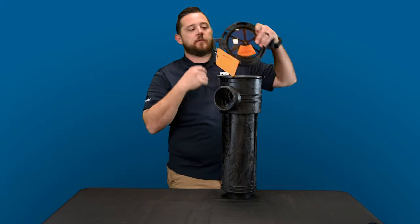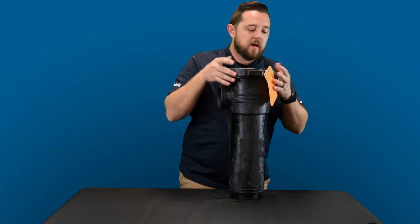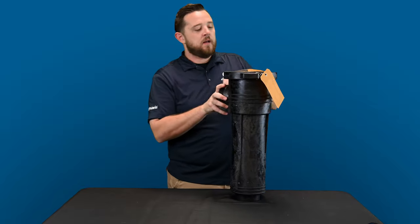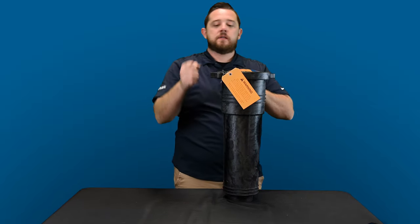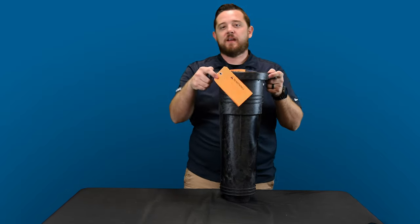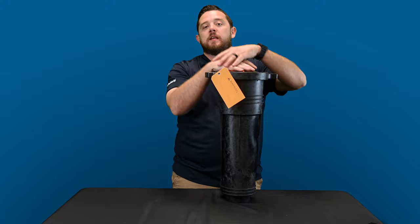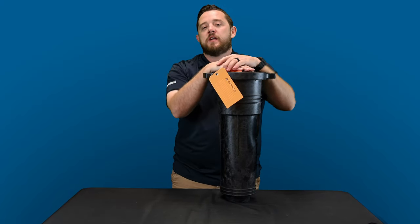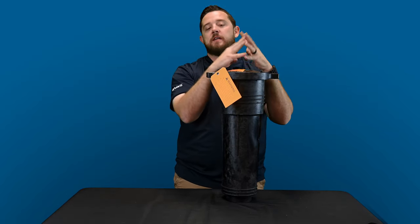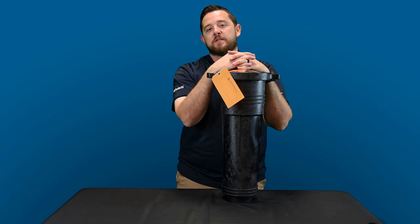I know I got the crew working on some blogs to provide you guys with more information. So go ahead and twist this lid back on — it falls in, it's got spots just like your pump lid does, its own little spots to lock in. Rubber mallet only — don't ever use a hammer on this. It is still a molded plastic, so the last thing you want to do is snap that and end up having to dig out and replace the entire unit. I really appreciate you guys watching. Any questions, check out the links in the description. Make sure you guys like the video, please be sure to subscribe. We're going to have more what's in the box for ANA stuff as well as some onsite videos so you guys can check these things out in action. Until then, I'm Kyle from ePoolSupply and we'll see you next time.